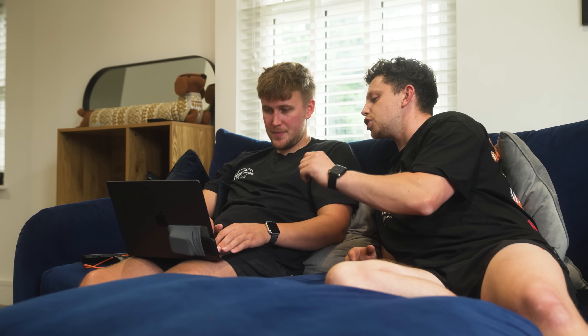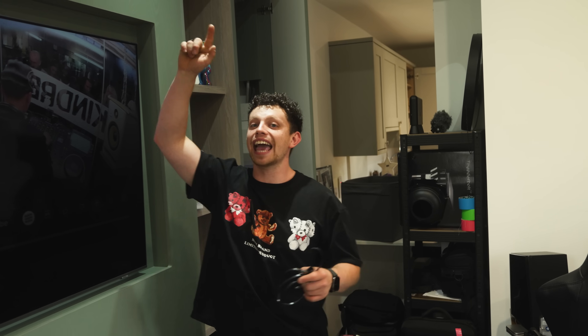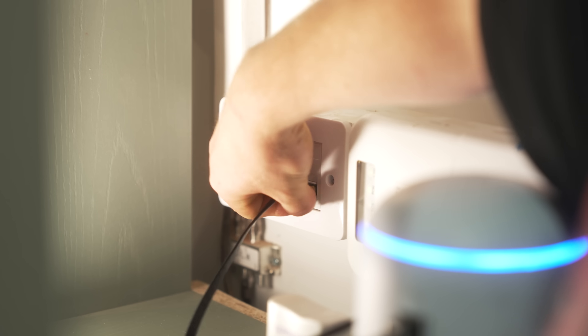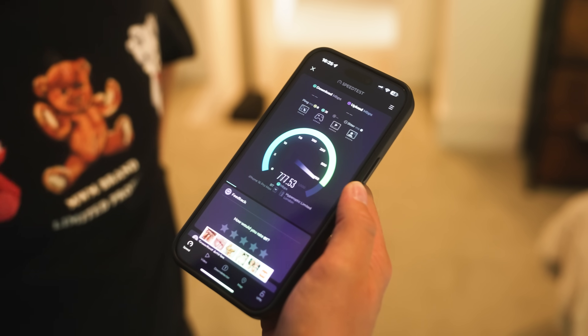You could also limit the speed of that specific guest network — say only 5 meg each — but for mates you'd probably just give them the full whack. In about three hours we've given Elliot a full UniFi experience and three AI cameras to protect his new gaff, and everything is working. We also needed to get Elliot's TV connected upstairs — trial and error on the data cables — picked up an IP address, LAN connection in, ping, lovely. Network connected — six gigahertz upstairs. Smashed it.